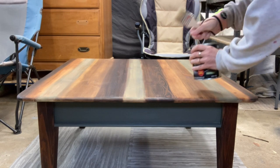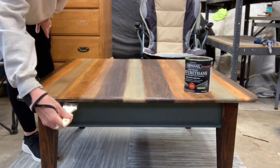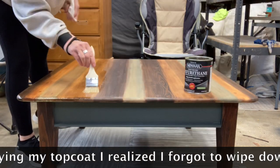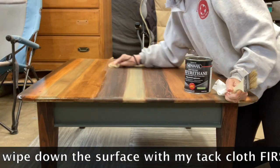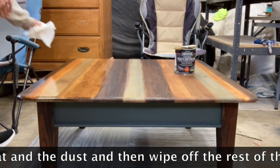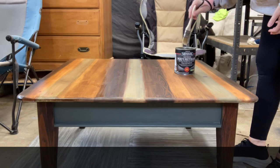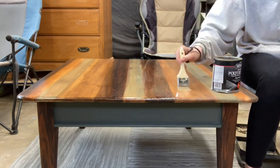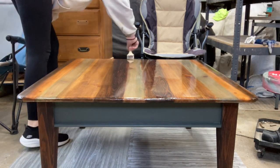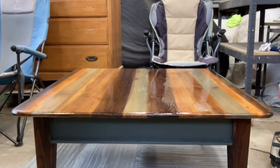I am using Minwax Polyurethane Oil-Based Top Coat. All I had to do was wait for the stain to dry and then apply my top coat, because it's oil-based and the stain is oil-based. If it were a water-based top coat, I would need to wait at least a week — I like to wait a couple of weeks — because if the oil-based stain is not dry you may get cloudiness in your top coat. The downside to an oil-based top coat is that it takes three to four hours before it's dry enough to sand and put a second coat on, then a third, possibly a fourth. I only use two coats unless it's something like a tabletop that gets used a lot, in which case I'd do three to four coats.